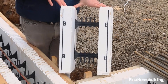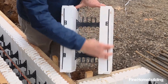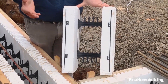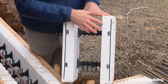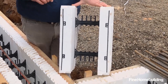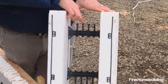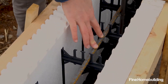A little bit about the ICF itself. Essentially it's two pieces of two-and-a-half inches of EPS foam — that's expanded polystyrene foam, the same stuff you'd see in a coffee cup with the little white plastic balls. These two pieces are connected by a plastic strut in the middle, and it's designed with clips that allow us to clip the rebar directly into it, either on top or on the bottom.